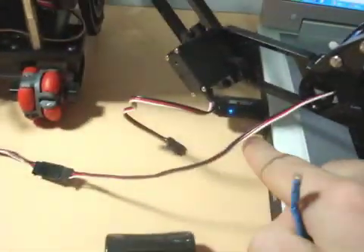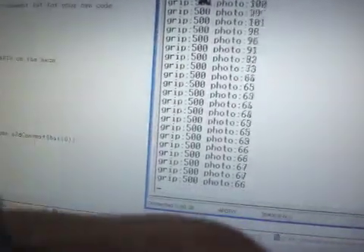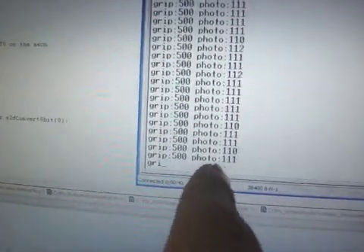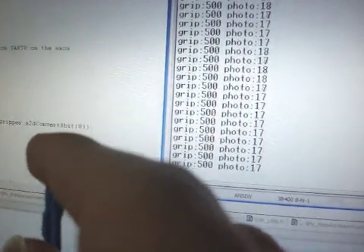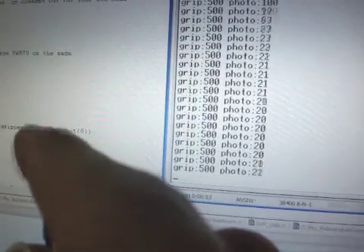What it's doing is taking data from the Axon, transmitting it via Bluetooth wirelessly, going into the USB key, and finally into HyperTerminal. The first thing I want to demonstrate is the photoresistor — you see the number right here. If I push on it, it gets dark and the number goes low. If I don't, it gets light. Dark, light, dark, light.